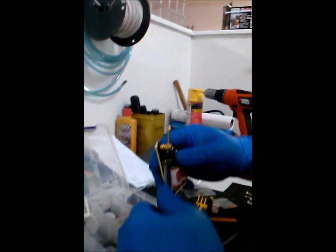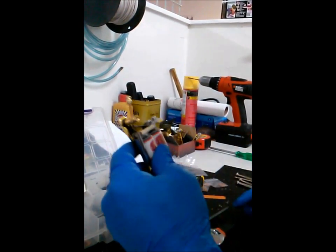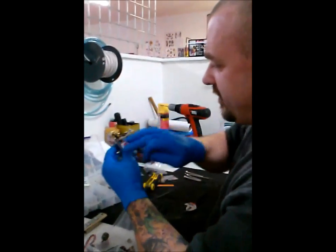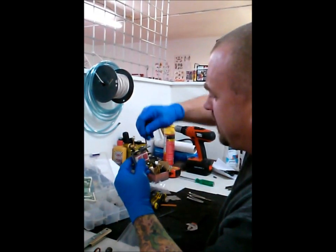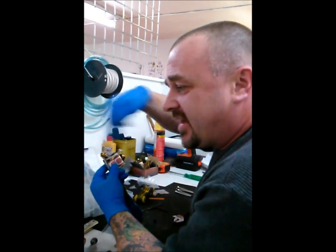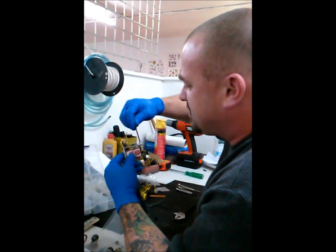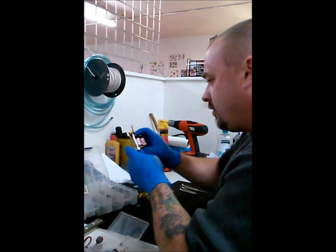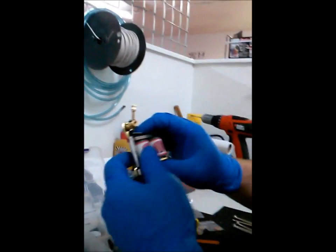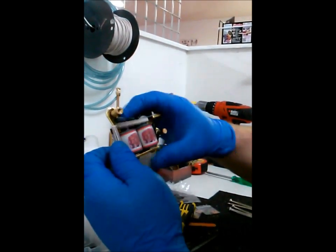So what I'm going to do is tighten this tube vise down, keep everything dead center. This is so we don't get lost later. I'm going to tighten this down just a little bit where this is dead center. The reason is because I've got more slot in my spring and I can go further back, but I'm going to take a marker and create a line back here so I know where my bend point is. You'll see what I'm talking about. Let's just snug this down. Okay, this is snug right where this is top dead center. It sounds like I'm working on a car. The armature bar nipple is dead center over the tube vise.